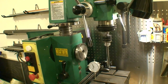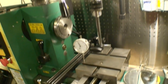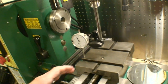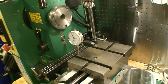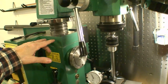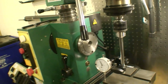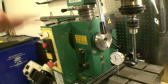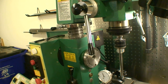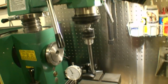One of the first things I did was remove the chuck to be able to use my dial indicator to swing basically in a circle. I'm tramming against the table like the big boys show, even though it's a very small table and I'm not sure how accurate it's going to end up being. As I tried to figure out how to shim this and line up the spindle correctly, I kept trying several times and kept getting quite confused about which direction the head is versus the table.